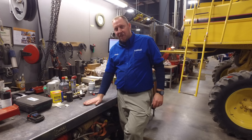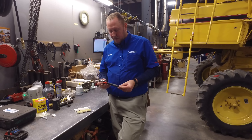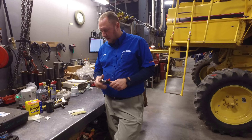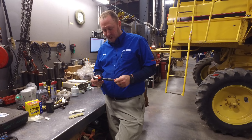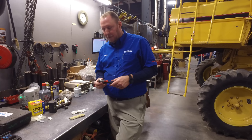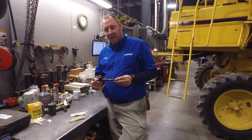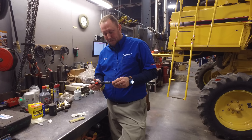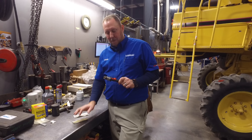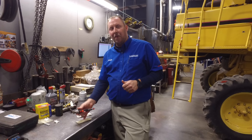All this filtration helps to keep these — which is an actual SVL 90-2 injector, common rail system — from suffering damage if you do not run an OEM filter. Here at Messick's we have changed out several of these injectors, some with OEM filters and some without, but this is the end result. These injectors are very expensive. So this is what you're protecting. It might cost you a couple dollars more to get an OEM filter, but if you have to pay for even one of these injectors, the OEM filter is a much better choice.